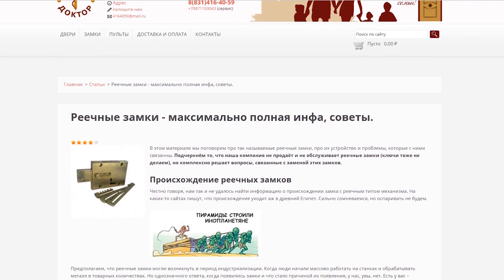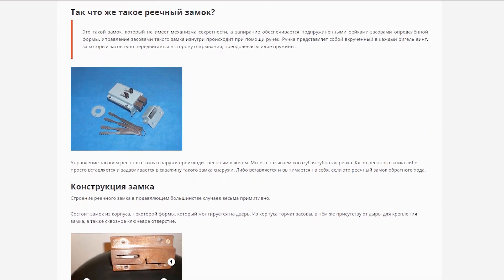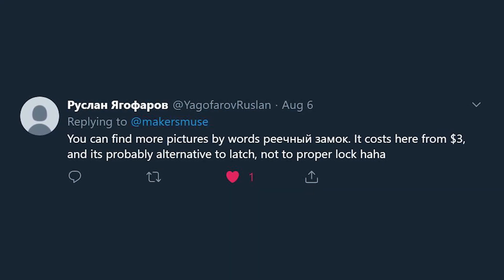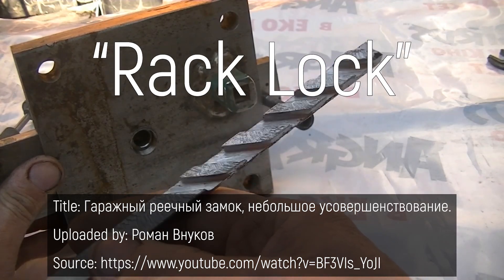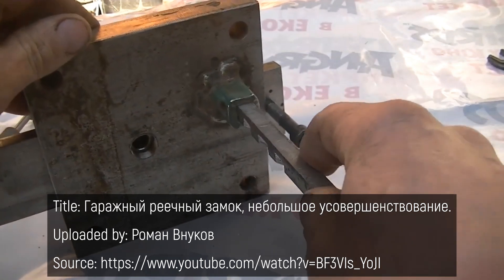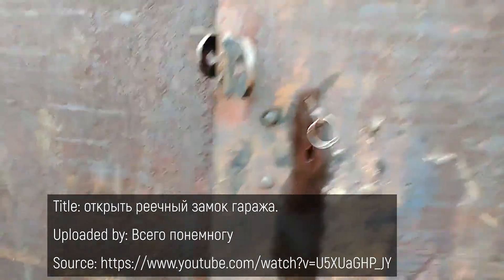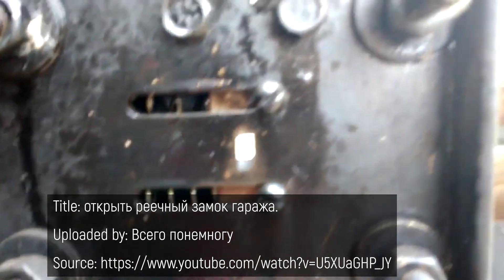So that's fun but I just had to find out more about the origin of this lock — and apologies to all of my Russian subscribers who have already been screaming at the screen, because it seems that this design originates from there, albeit a relic of the past. As Ruslan stated on Twitter, it's more of an alternative to a latch, not a proper lock, as I'll soon explain. According to my research, rack locks are absolutely bulletproof and won't freeze up in the middle of harsh Russian winters, unlike many more modern delicate lock designs. Therefore they're often used to secure sheds and garages, and I've also seen them used to secure security doors on old apartment blocks.